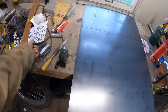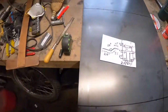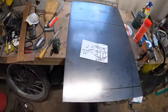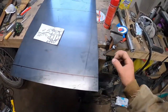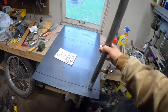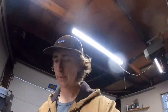I got my marks laid out according to the plan: 275 down here, 350 in. From the base it's 24 and a half, then 625 in, and then 325 in up here. Now we just gotta punch the holes. I'm going to use a hole saw to drill out a slug, and then I have inch and a half by 120-wall tubing that I'll be using as my spacers. I'll cut that down and use the plugs from the hole saw to patch in the top piece.